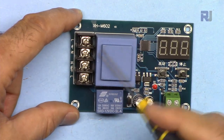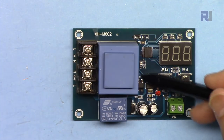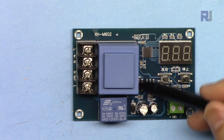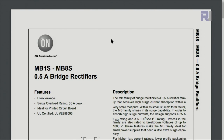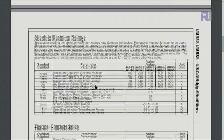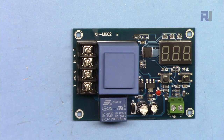The output voltage is 12 volts AC converted using a bridge rectifier. AC arrives at two pins and DC is output from the other two. This converts 12V AC to DC. The component is an MB6S - a 0.5 ampere bridge rectifier with 600V RMS rating. The current rating is what matters here since we're only using it up to 12 volts.